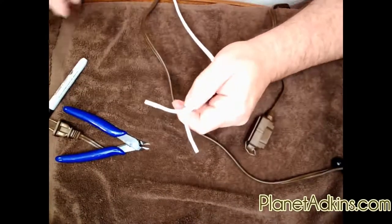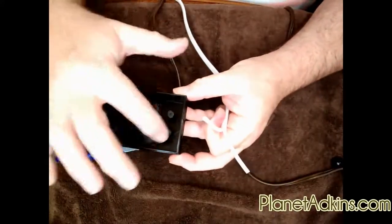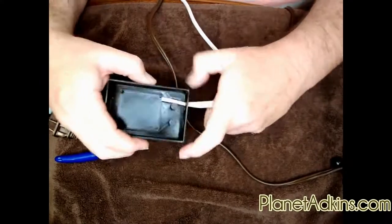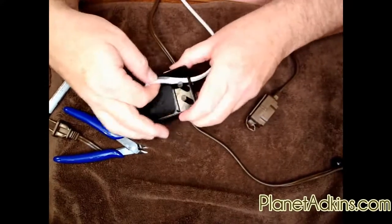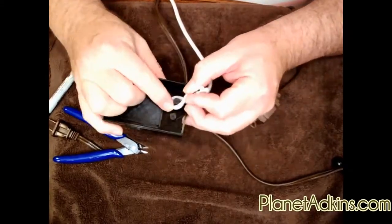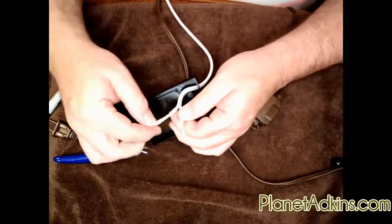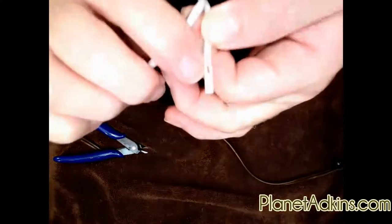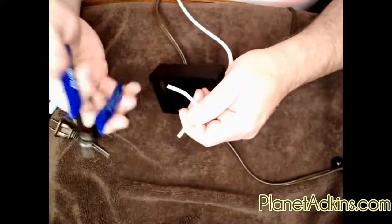We have this 3D printed box. You'll see two posts — the design allows the cables to come in and loop through, and I'll zip-tie them to the posts as strain relief on both sides. I just noticed there's a bit of exposed copper on one wire — we don't want bare copper on the hot side, so let's trim that off.